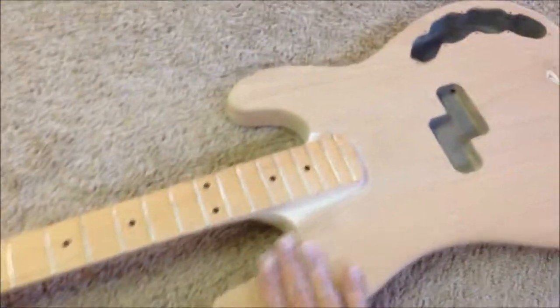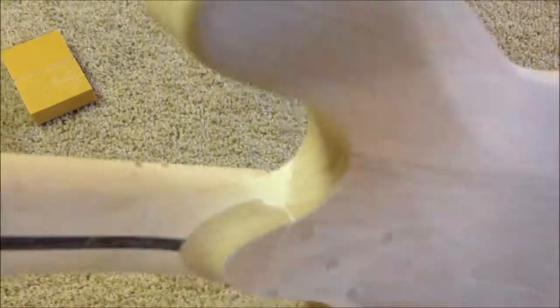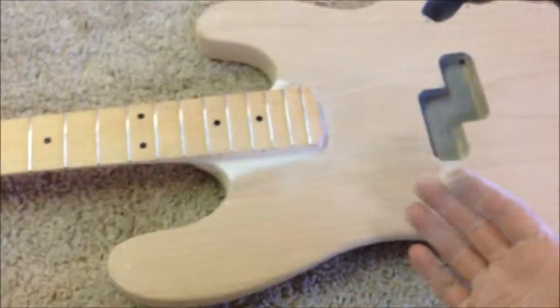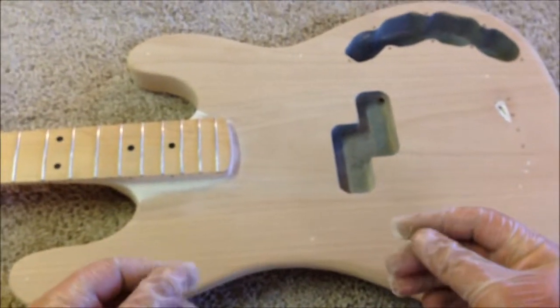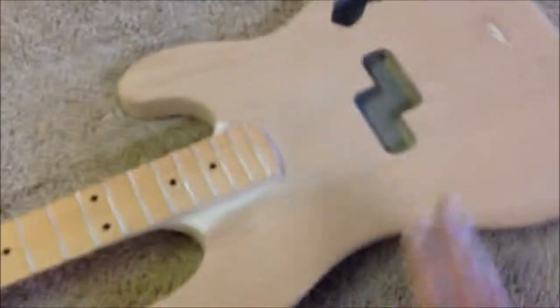I've been sanding continuously. I've filled in the areas that I think needed some wood filler to feather in and look more like it's going to be a through-body neck once it's all painted. It's come out pretty good — it's looking great. I did get a couple of little air holes. I'm wearing gloves because at this point my hands get dirty and I don't want to leave stains on the wood. To be honest it doesn't really matter on this particular instrument since the whole thing's being painted, but it's a habit of mine. I don't want to leave any grit you can feel — I want this to be as smooth as possible.